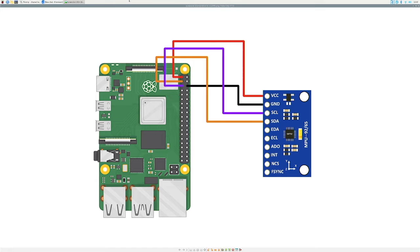We just want to establish the physical connection between the MPU 9250 and the Raspberry Pi. Connect those respectively as you can see in the diagram. We have VCC and ground to manage power on the device, and then we also have the SCL and SDA pins. These are characteristic of I2C communication. If you're new to the space, this is your first time seeing SCL and SDA — you're going to be seeing a lot of it.